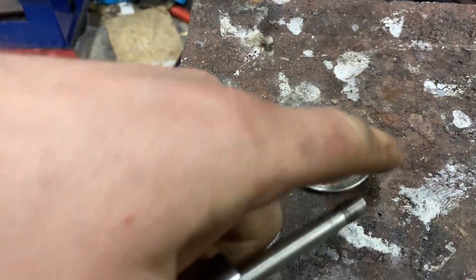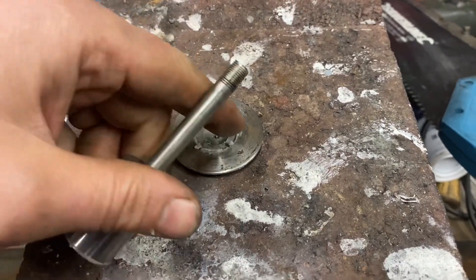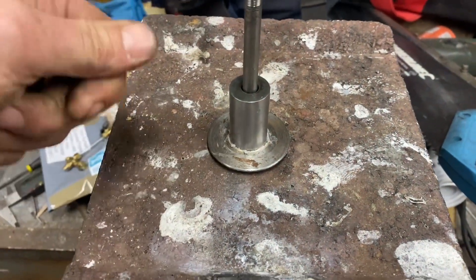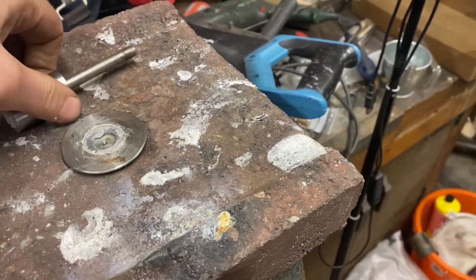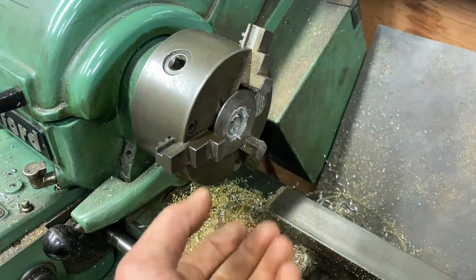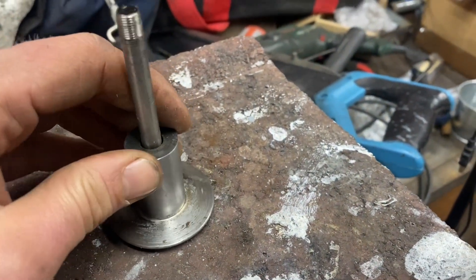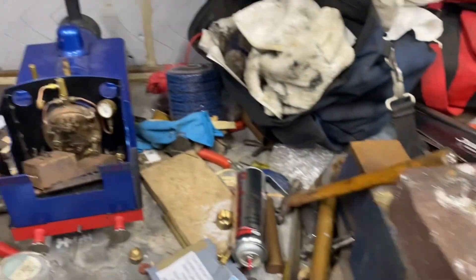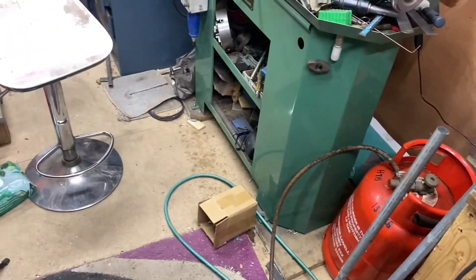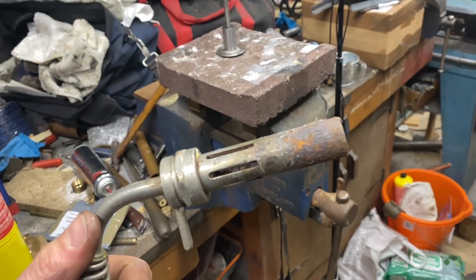So this has had a good clean up. This piece, although it looks dirty, I did put it in the lathe and I used the boring bar to clean up the inside faces and just skim just at the edge so it is all clean. I didn't want to go any deeper than that because I didn't want to use the emery cloth — it was tucked up inside and as you can imagine, with that spinning, I didn't want my fingers in there. So the area that the solder is going has been cleaned. We've put some flux on, and we'll put it together. We have a map gas torch and a propane bottle — I might just use the map gas to light this and do it with the propane. That may well get a bit hotter.